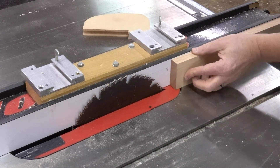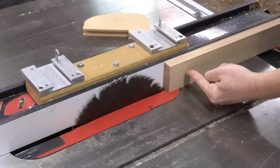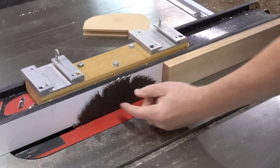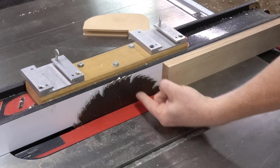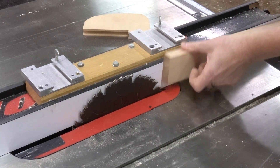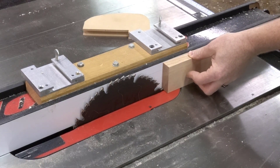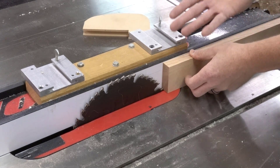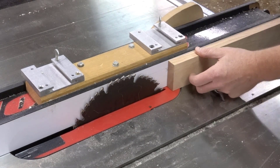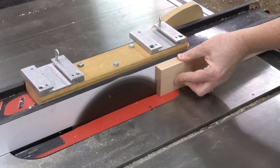The technique is your left hand needs to have the thumb on top and you're pushing the board against the fence right in front of the blade. Never ever should your left hand be pressing it where the blade is — your hand may pass by it, but never push against where the blade is, because that's when you get burns and it wants to kick back. So keep your thumb on top — that's what holds it from doing this — and keep your fingers on the side, very similar to a jointer. My right hand is on the back of the board. I'm going to start without the push stick, but it is in reach. And I'm going to start pushing it across. Put on your safety glasses. Just push across.